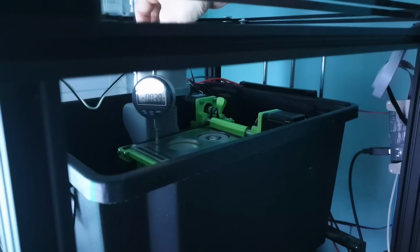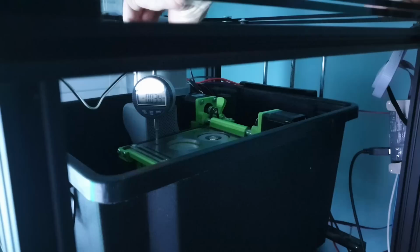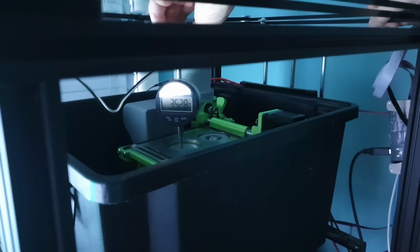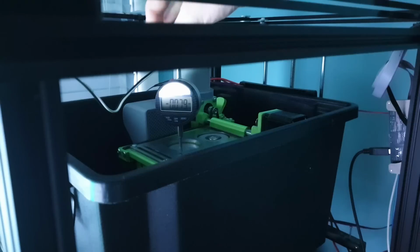So after setting up the lens assembly, I proceeded to level the bed. Now this is a very painstaking task given the amount of time it takes, and really points towards some deficiencies with this current setup. Since the powder bed is effectively floating on 2 lead screws, there is a lot of potential for error. To make matters worse, even though the laser head is mounted to a linear rail, since we want accuracy in the order of micrometers, there is still an unacceptable amount of play.